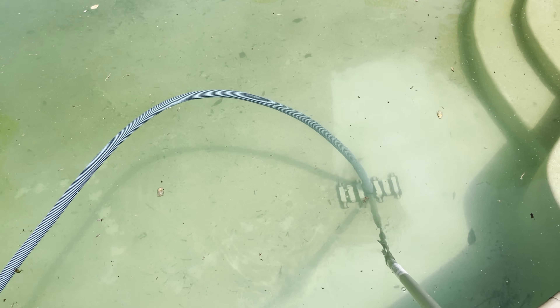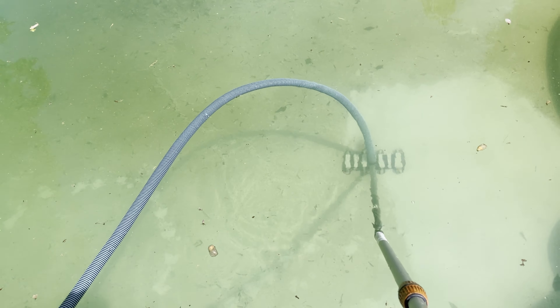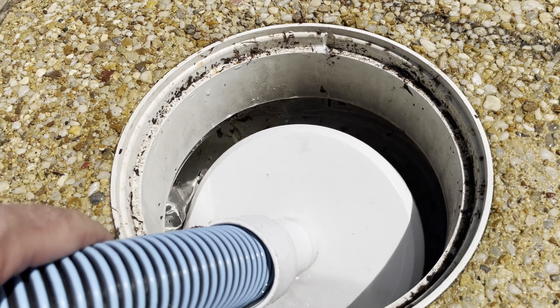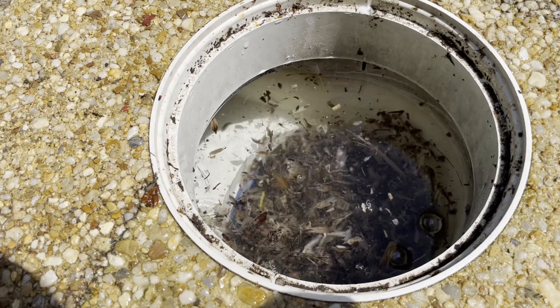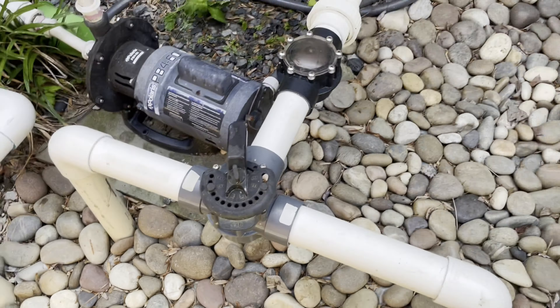There's a lot to do, but you just vacuum the entire floor, getting dirt, large pieces, and debris off the bottom. I divert all water to one skimmer and block the other off — no drain on the main — so I have the full amount of suction. Every once in a while the suction drops, so I turn it off, pull out the basket, empty it, and turn it back on. I usually go through at least two or three basket iterations. I also check the main pump basket and clean it out while I have it open.